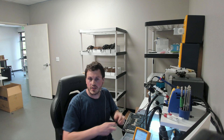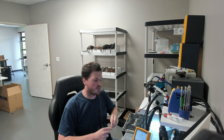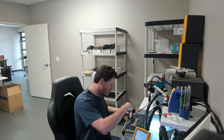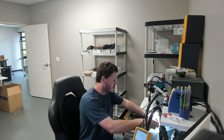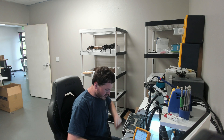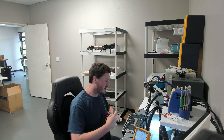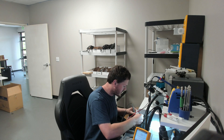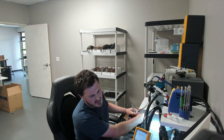The very next thing I want to do is unplug the screen. Sometimes screens fail and cause a short to ground on backlight output. I'll remove the connector by unscrewing the two screws and unplugging it. If the short is gone, we know we have a bad screen. The fuses usually don't blow on this model because the backlight driver is good at sensing shorts. With the screen unplugged, we still have 15 ohms to ground, so we definitely have a board-level fault.